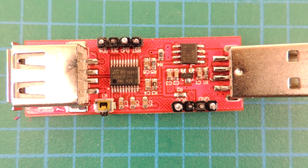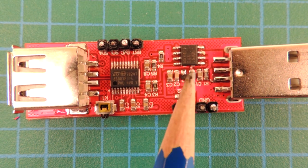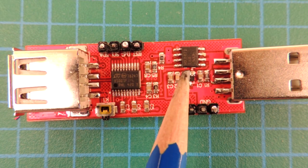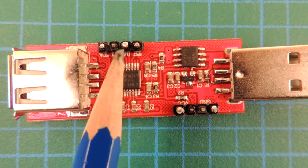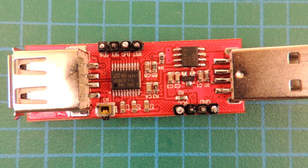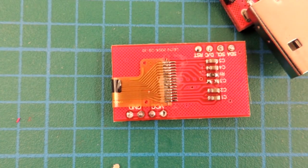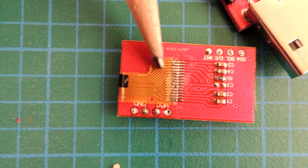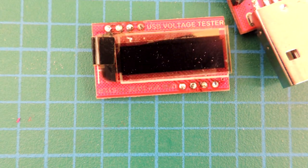Here's the display removed — this is the bottom. Two active semiconductors, very appropriate choices. This is the MAXIM MAX471, a high-side current sense device, which makes sense. The current runs from one connector to the other through this device and produces a readout for this little microcontroller — it's an STMicro. That STMicro is connected to an I2C bus and some power connections which go up into the organic LED display. You can see in the back the data pins and control pins for the I2C bus and then some power pins, and they've obviously just soldered this cute little display onto this carrier card so it can fit. Pretty straightforward topology and all quite appropriate.